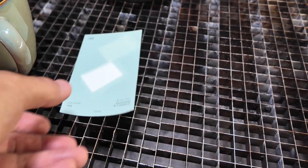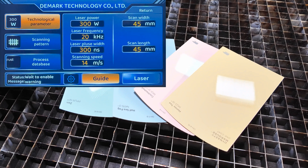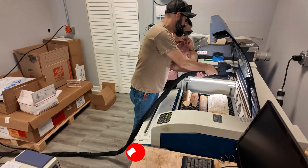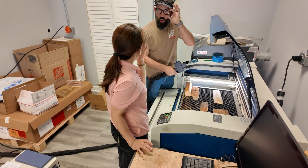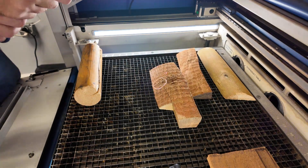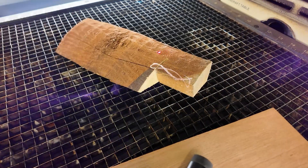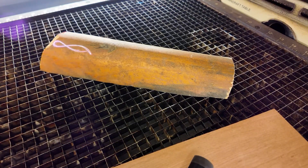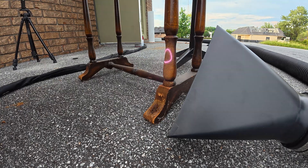Finally, a very delicate challenge: painted paper swatches from Home Depot. With just the right technique we were able to remove the pigment while leaving the paper completely unharmed underneath. This demonstrates how you can fine-tune a pulsed laser cleaner to be very surgical when removing contaminants without harming the substrate. Laser cleaning takes experimentation — trying different patterns and parameters. Some jobs are wins, some are learning moments. The key is to always test first on your own stuff. Having these 10 base settings built into the GT500 is amazingly helpful for jumpstarting a laser cleaning business.